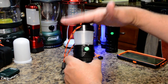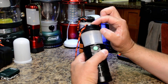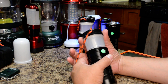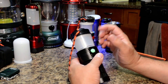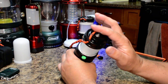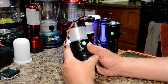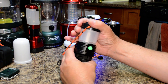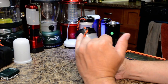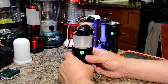Starting from the top down: the very top is a solid chunk of aluminum I machined, roughly an inch thick, the same width as the whole lantern. It serves as the heat sink because I use down-firing LEDs on top, so the heat is concentrated up here. It has a flat top with a bolt — you can add a CPU heat sink or fins for modifications. Even at 1.5 to 2 amps on high it will run all night and get warm to the touch, but not hot enough to burn you, even without fins.